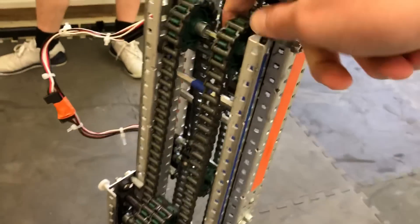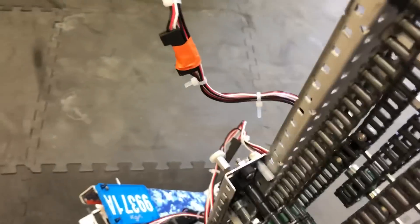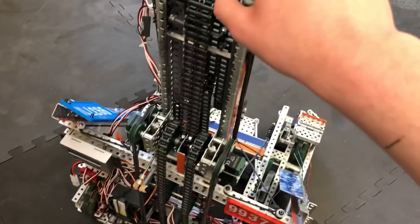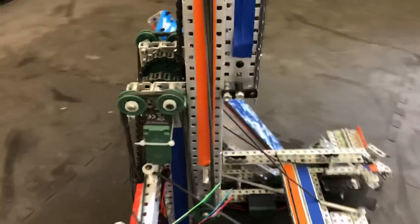I reinforce these on a bearing underneath, as you can see here, to make them stronger so they won't break or bend — they stay nice and strong and push up against the grease, sliding smoothly. The chain inserts are actually circles so they spin freely to keep friction low. There are two per link: one for strength, and also so that if one breaks the lift will continue to work. If we lost one link or even two, we could still run the whole lift in a match.